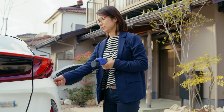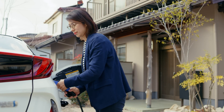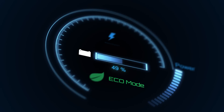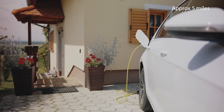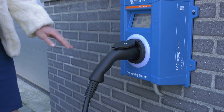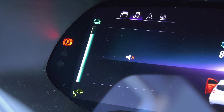When buying an electric vehicle, as standard they come with a single phase power adapter to connect to a domestic electricity outlet. With a power rating of up to 3 kilowatts, it provides around 8 kilometers of range for every 30 minutes of charge. This new charger from Victron Energy increases the vehicle charging power if the vehicle is capable, so you can do more driving in less time.